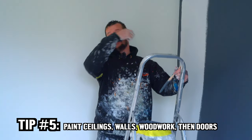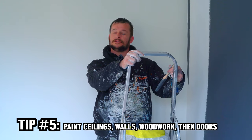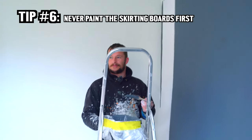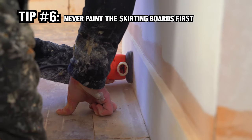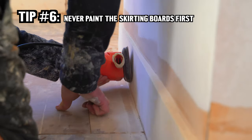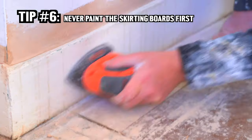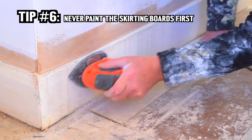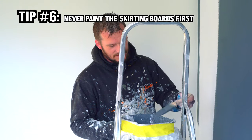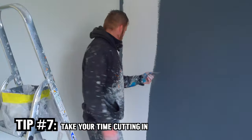Obviously when you cut in and you're rolling, you get all the splatter and it'll end up getting on all your fresh walls — then you've got to redo your walls. Is there ever a time you'd want to paint the skirting boards first? No, never. If I'm waiting for the walls to dry or want to get into another room quicker, I would undercoat the woodwork but wouldn't satin wood it, because that's your final finish — the undercoat just gives it a good base.